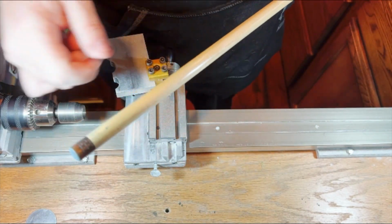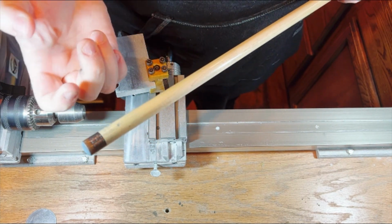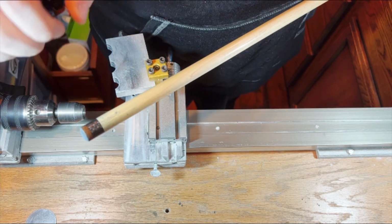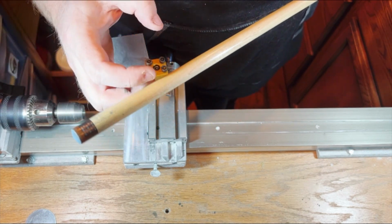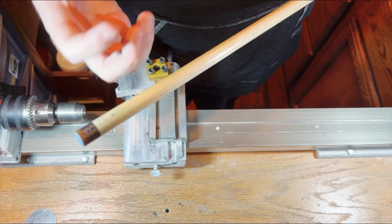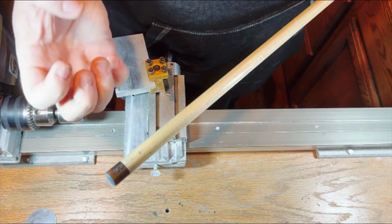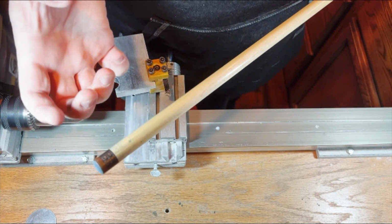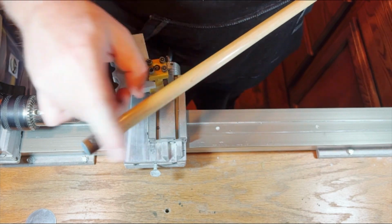You'll see those, like people say use a shot glass, or they have those glass rubbing tools. Don't do that. You're really just compressing the rest of the wood down to the size of the dent. And what you're doing with water and steam is injecting steam into the spot to pull that dent back out, to swell the wood back out to its natural position. If you press down, you'll actually feel a divot in there.